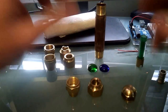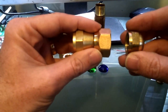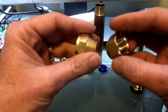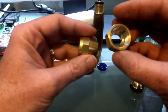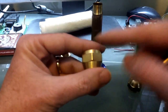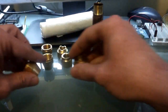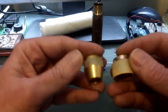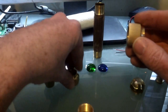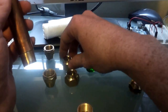This is the hardware just as you buy it in the store with the hex heads — a half-inch flare, a half-inch reducer, and a half-inch pipe cap. The pipe cap I never did anything with. The reducer gets a lot of work because there's a lot of metal there and it's the one I shape the most. I sand off the hex head and then it also gets the dog collar cut into it. Once it's belt sanded, I try to reduce it as much as I can to get it about the size of the body so it sits flush without flaring out a whole lot.